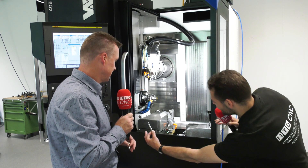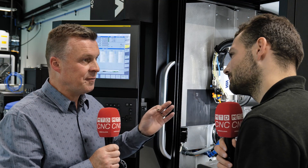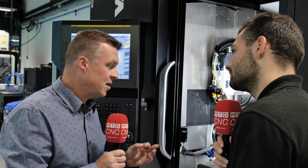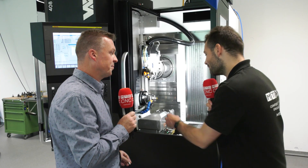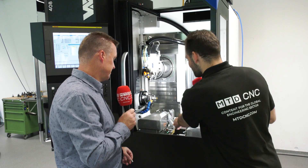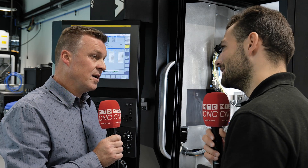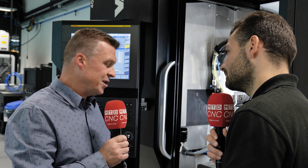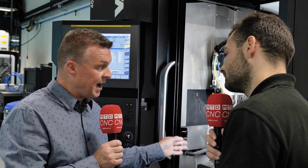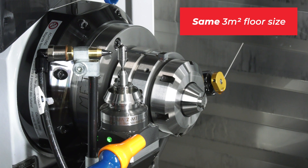It's almost like you've got an extra little machine tool just down here in this corner of this already very compact machine. On the same dimensions as the 408 MT standard configuration, we have integrated three additional axes for simultaneous machining. And there's also a tool changer fitted, plus a little spindle — what's the max RPM? This spindle maximum RPM is 50,000, with fixture HSK E25 and an eight-position tool magazine. So we've got an E40 on the main and E25 here — these are all tiny, well-balanced tools easy to spin up to 50,000 RPM.